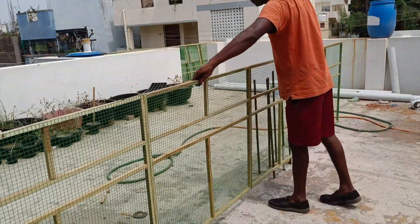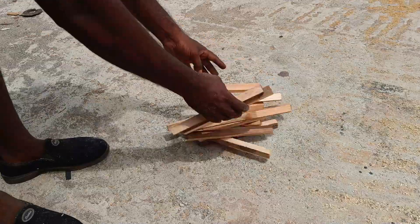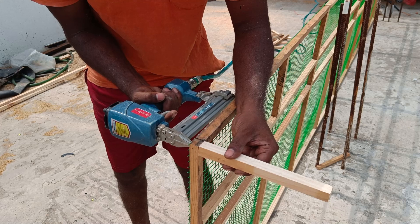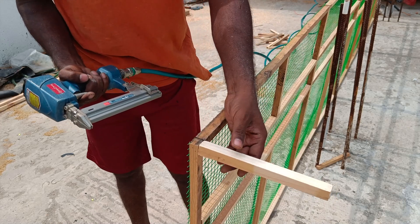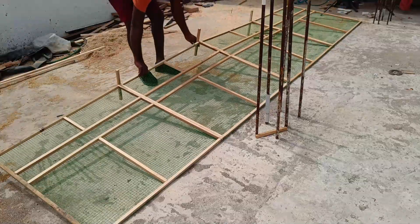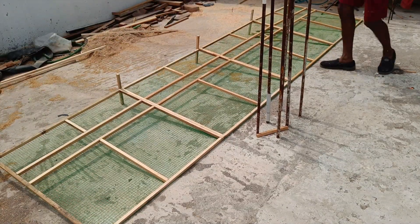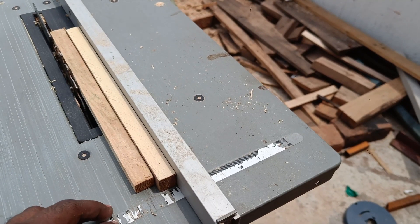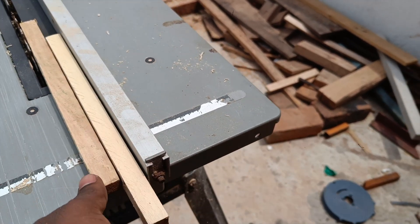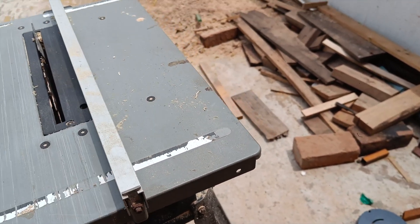The long sides of the chicken pen have four panels in a row. Right now the structure is too wobbly to stand upright, so I got some cutaway scrap wood and nailed it to the bottom of the panel so that it can function like a makeshift stand. Now I need runners double the size of the previously cut runners, so I simply place two runners side by side and set the fence and repeat the process.